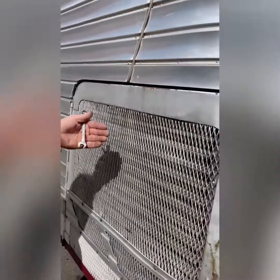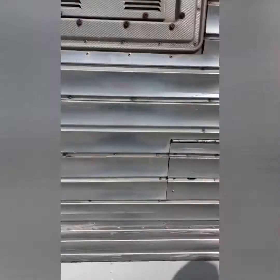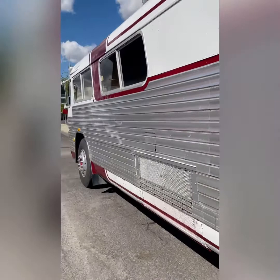The shutters are open on the radiator at 160 degrees. The shutter control valve is leaking air, and when it cools off these shutters will close. In cold weather the motor will warm up. If you listen closely you can hear the air leaking out right between those two components.